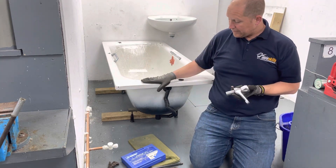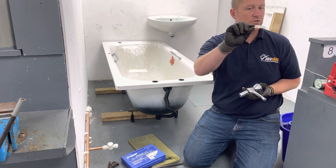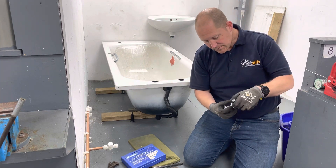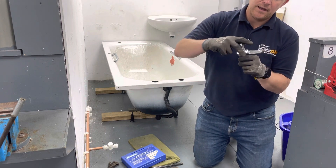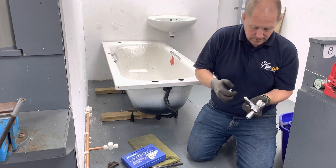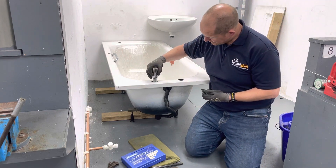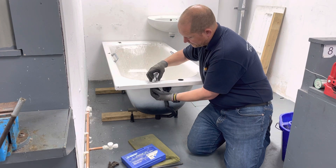For a steel bath, because it is thin, and also for a kitchen sink because it is thin, we also need a spacing washer — we often call it a top hat washer. It will come with a half inch insert for your kitchen tap, and we'll pull that out to make it three-quarter for a bath tap. The reason for this is the thread doesn't necessarily go all the way up to the very base of the tap, so if we put the tap onto a stainless steel bath or kitchen sink and do the back nut up, the tap might still be loose. So you fit a rubber washer on top, spacer top hat washer underneath with the back nut, and then do that up finger tight.